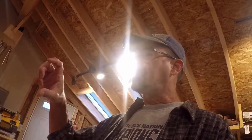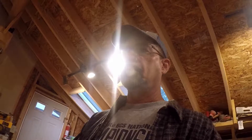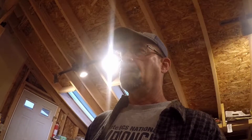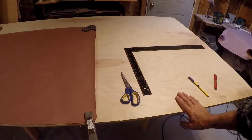I'm planning on the ribs being about two and a quarter inches wide — a good balance of sufficient strength. Really the ribs are primarily for holding shape as the boat is built, but they become helpful to hang structures to as well. You can make that out of boards, but then you have to arrange for the joints where it goes down the side and at the chine. The nice thing about plywood is I can just lay the pattern out and cut it — it's a little more wasteful of the wood, but that's the trade-off. I've decided to do plywood ribs, and these are permanent in the boat.